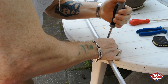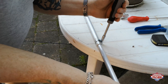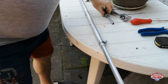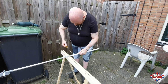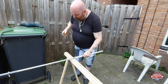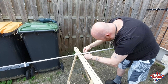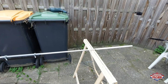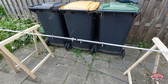Here I put the elements together - aluminum pipes, almost two and a half meters long. Here you will see me connecting the PVC pipe with the aluminum element from the antenna, which I will use later for the coil. Inside the PVC pipe is a little piece of other PVC pipe for insulation between the elements.